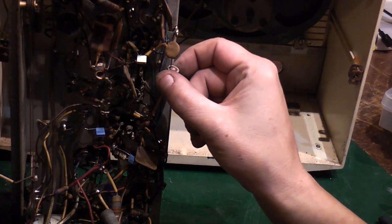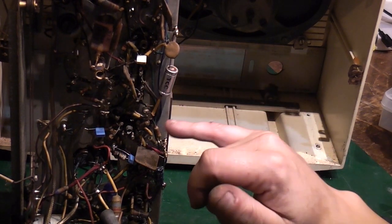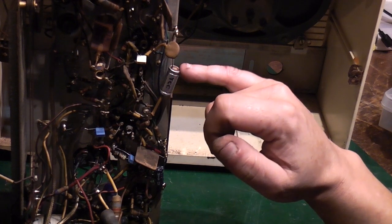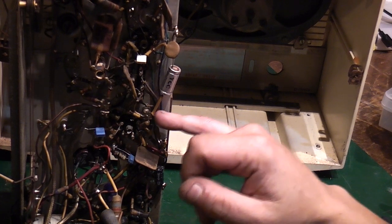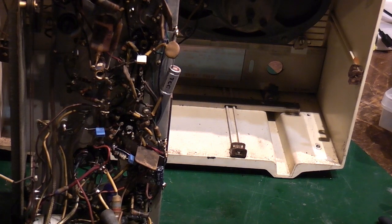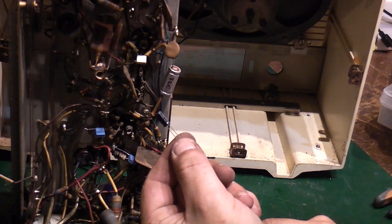Right, let's get you up there now. The only thing really I want to change is that capacitor there. It's obviously grid bias for one of those valves, because it's negatively biasing something: we've got the plus side going to deck, the negative going to a point there, which I'm guessing is going to one of these valves around here. So let's get rid of that. I've actually got a replacement for it out somewhere on the bench. There it is. And we're essentially changing that for that.